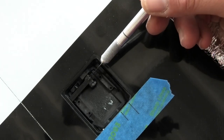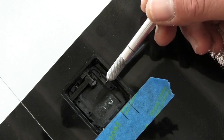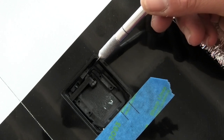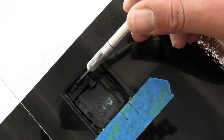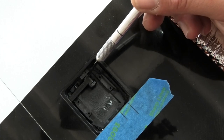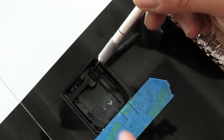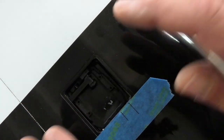I was hoping that the servo arm would line up perfectly with the IDS hub without any modifications, but that's why I sanded about a millimeter off the servo frame on this side, because it was misaligned slightly, so I had to get the tray going that way a little more.